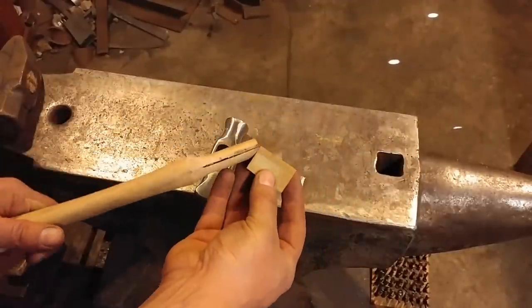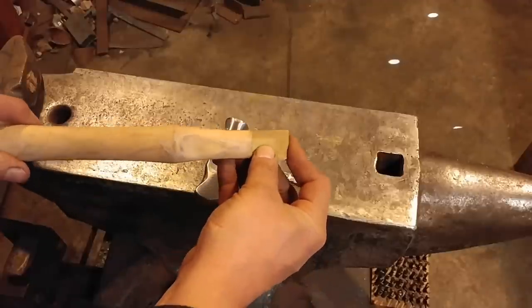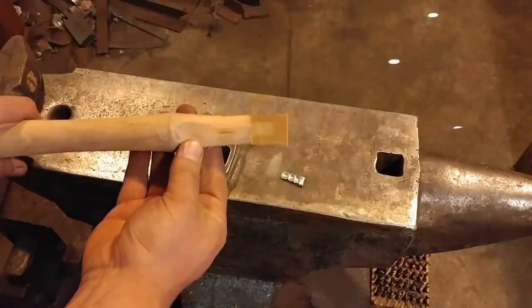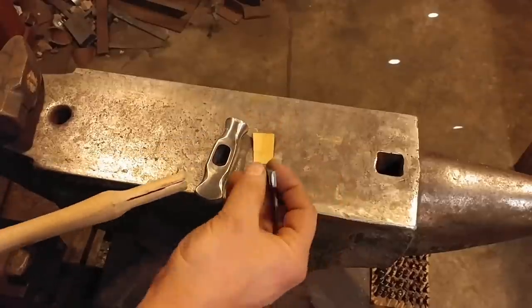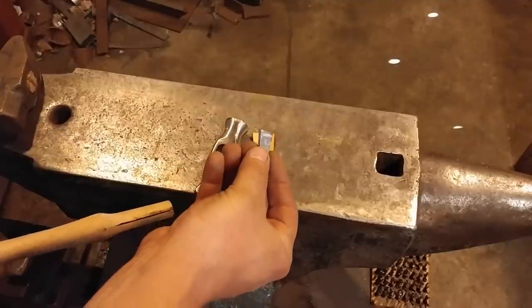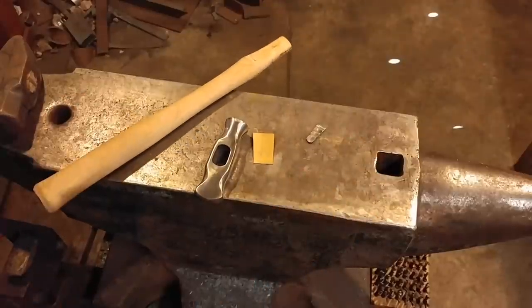What I was indicating with my thumb is to showcase how far that wedge is going to have to go down, and how we're not going to be using all of this hammer handle, so we will have to cut it off. I've already pre-prepped this wedge and made sure it is good and clean and ready to go. We'll decide whether we're going to use the metal wedge or not — it's optional. The wood wedge should hold just fine.